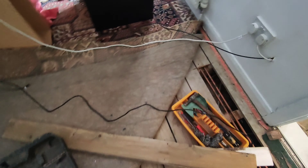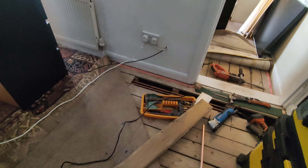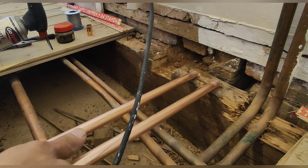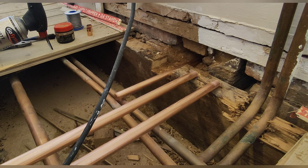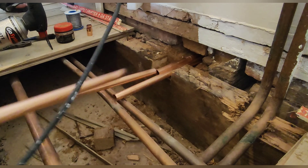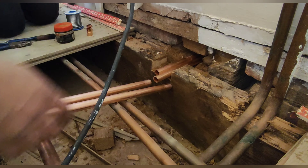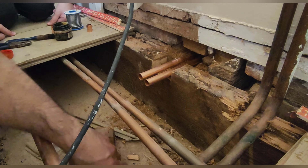What I'm doing here is putting a long stretch of pipe - three full lengths of 15mm copper pipe - pushing them through from the existing location all the way through the floorboards. I'm using solder, joining these together myself. I had to include a join because a full length of pipe was not enough, so I'm putting a join in to make them slightly longer for the hot and cold water. If you've done it before it's straightforward; if not I'll give you a crash course.